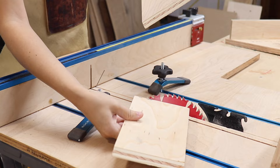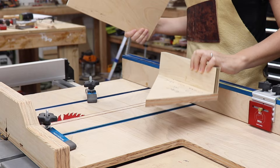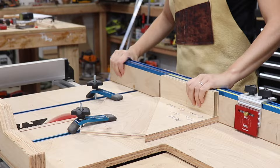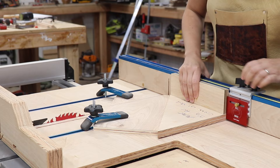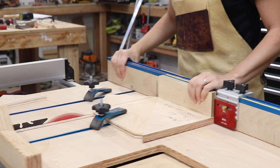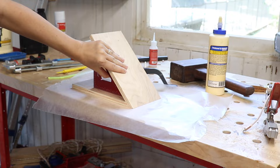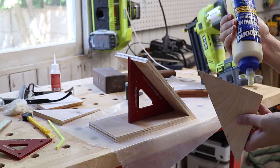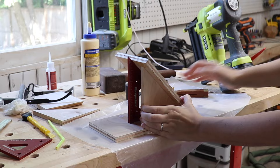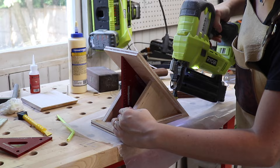The third attachment is for shooting long miters — also pretty easy to make. I made one cut at 45 degrees creating two 45-degree edges to attach to each other. Before doing that, I cut some triangles out of scrap plywood to act as supports, using my miter jig from my crosscut sled with a stop block so that when I flipped the plywood I had two equally sized triangles. To assemble, I used regular wood glue plus a little CA glue to act as a clamp. I put a triangle between the two boards to keep the perfect 45-degree angle, then used a brad nailer to hold it in place, and glued and brad-nailed the support triangles on as well.